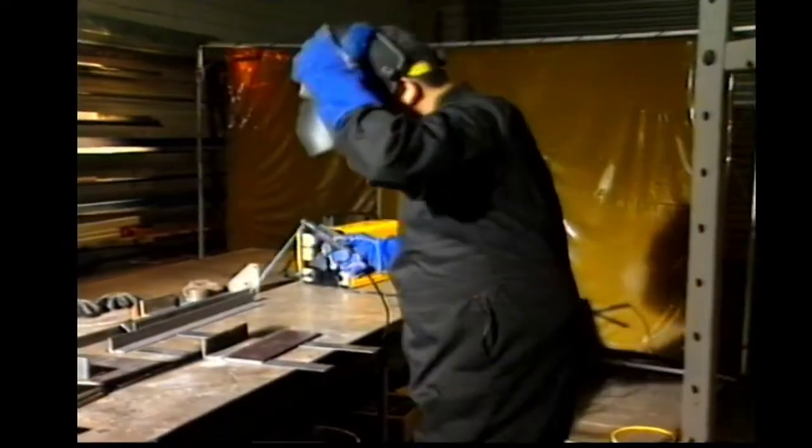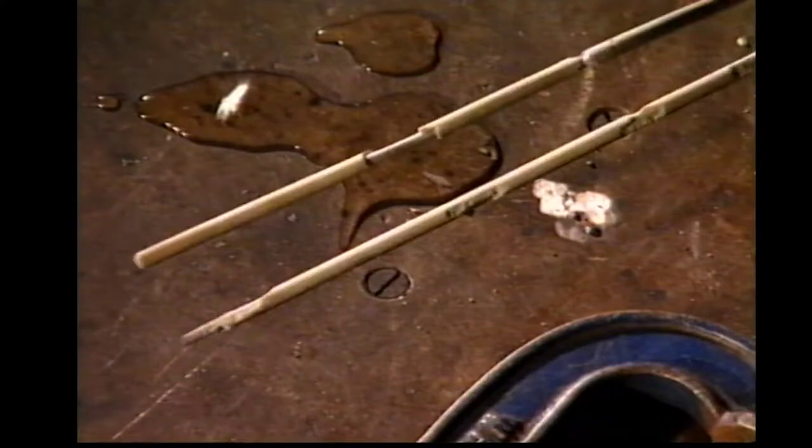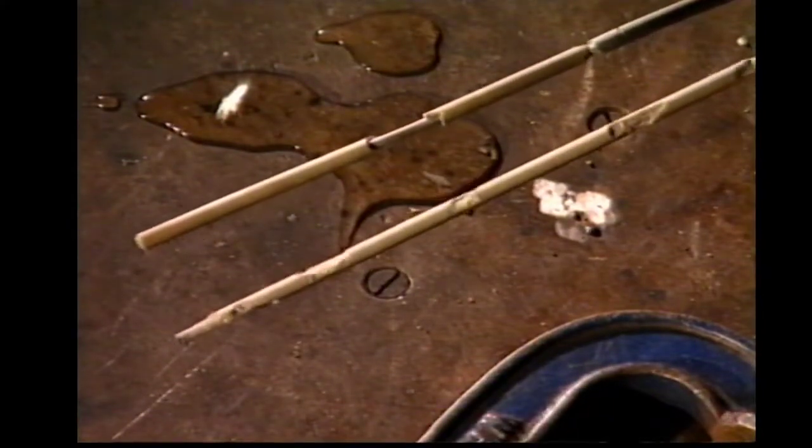An arc welder requires an electrode with flux on the outside. You fix the electrode in the holder like this, and you're ready. Arc is the traditional method where the operator strikes an arc with an electrode clamped in a holder, withdraws it a fraction from the metal and makes the weld. It's a wonderful skill. The key to any successful welding job is the right combination of amperage and electrode. Always remember to store your electrodes in a cool, dry place — damp or damaged electrodes make it almost impossible to weld correctly.